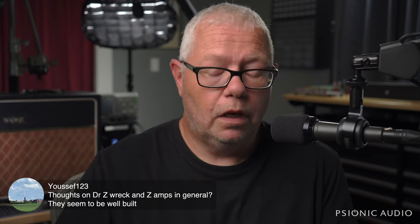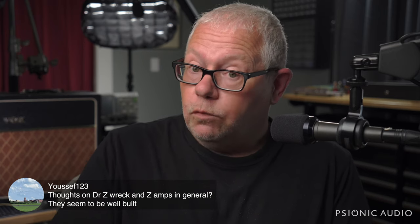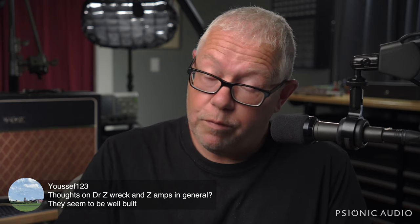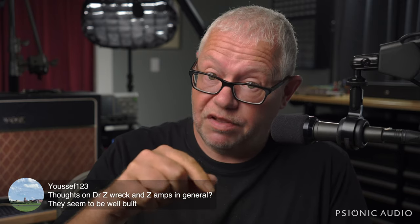Great. Enjoy it. Now, all that said, all Dr. Z's, in my experience, have some reliability issues. It's odd because in many ways the amps are overbuilt. They never quite got the full mil-spec memo where you don't do a full wrap, you do a 270-degree wrap.